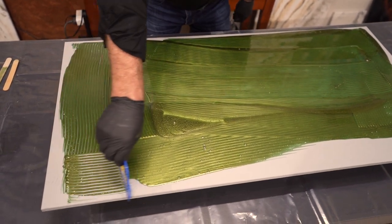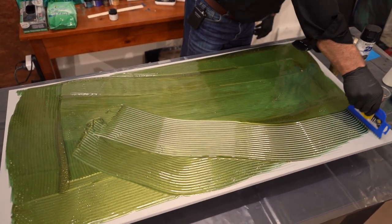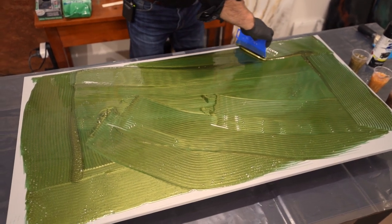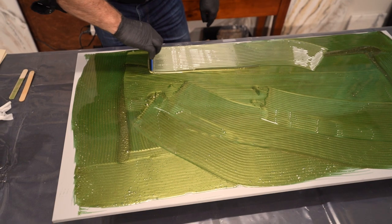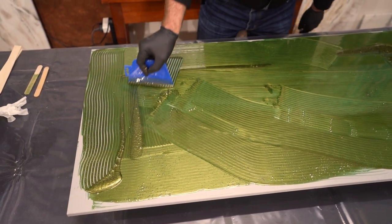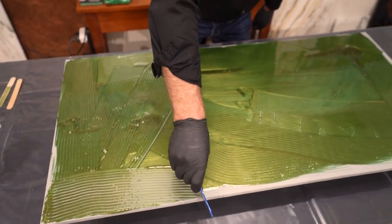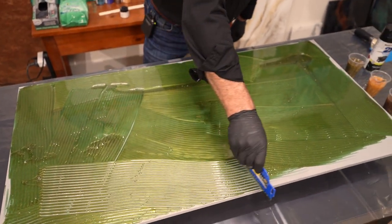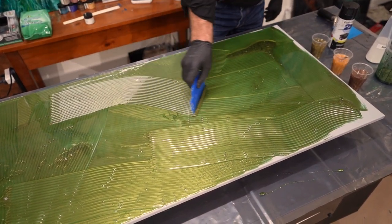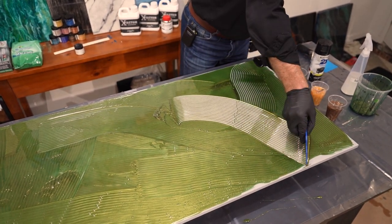This Kryptonite color is really great for a base color. It has a dark base but also this reflective light quality about it, as you can see as I'm trailing it out across the sample board. As a base color, I mixed it at a rate of one liter per square meter — enough to cover it and wrap around the sides for good coverage. For all my American friends, that's about three ounces per square foot. But remember, I have other epoxy colors in cups ready to be poured out, so there's more epoxy going onto the surface. For the base coat and a clear flood coat, it's one liter per square meter.